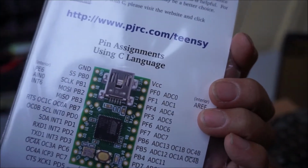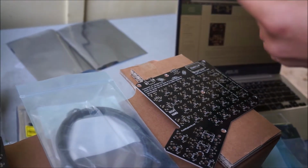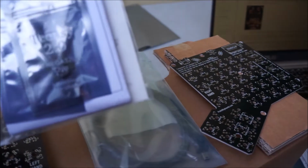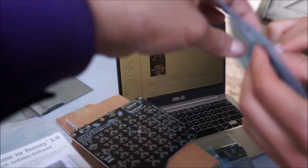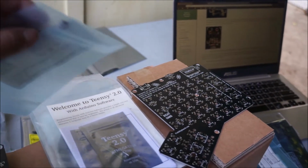Okay. We have a mini USB cable, which will plug into the teensy, and we're gonna basically cut it right at the end and strip away the insulation, and that way it'll plug in, and then we'll plug those exposed wires into the PCB. Oh, I see. So it's a hack. Yeah. And this is the mini USB to provide power to the keyboards. Okay. So that'll take a real cable and plug into your computer, right? One that you don't break.